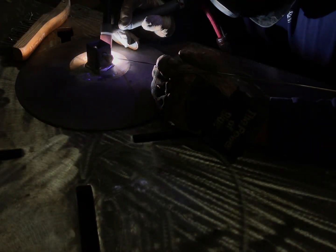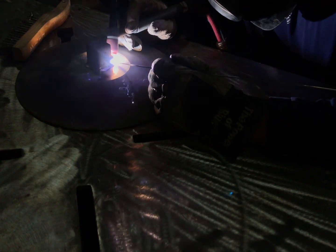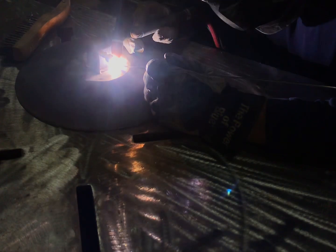I tried to secure that piece in as tight as I possibly could, then go ahead and start to make your welds. With any casting there are going to be impurities in there, so those will get brought to the surface. I tried to run this pretty hot just to try to pull everything out, but also to get full penetration — to help ensure that it doesn't crack again down the road. I went ahead and wrapped around this top piece; it was locked into place really good. Just do your fillet weld.